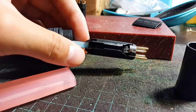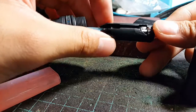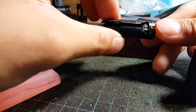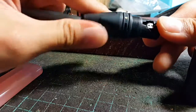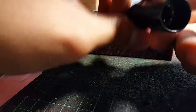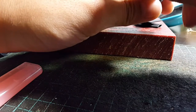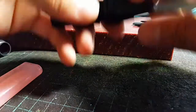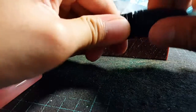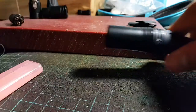After finishing the heat shrink tube, put the components back together. The shell has teeth on the inside that grab the heat shrink tube, so when you lock everything back it prevents you from accidentally pulling the cable out. Line up the positioning notches and twist to lock it.